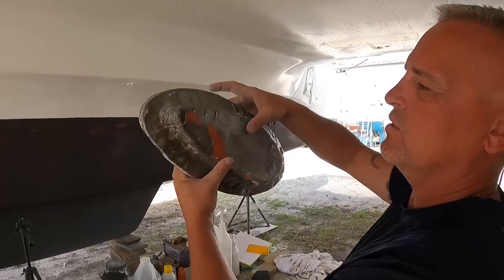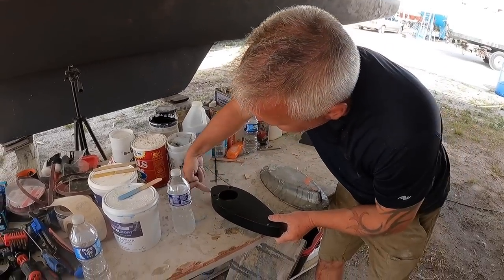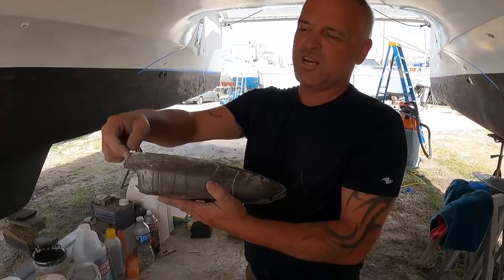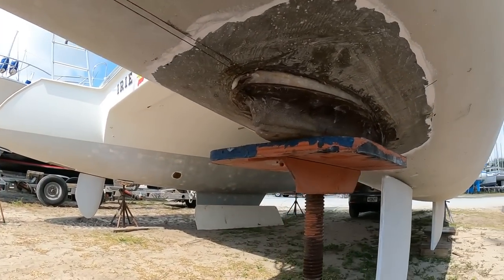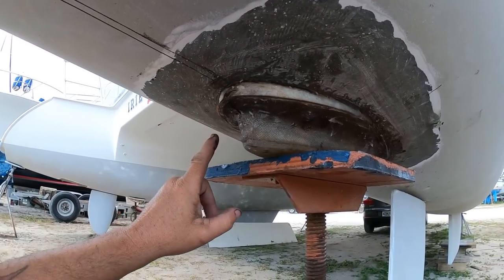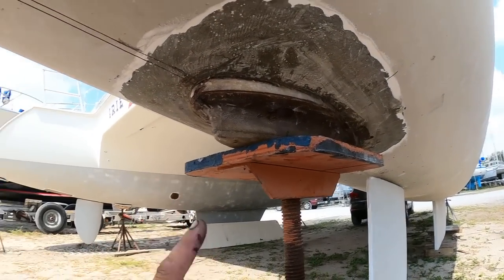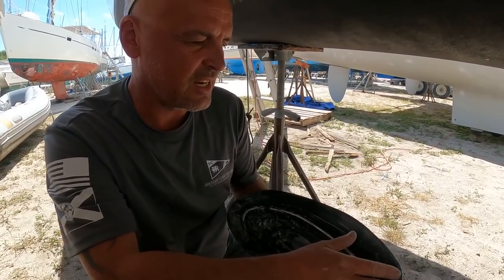I got all my measurements, turned it upside down, and this piece was sticking through with my new shape being angled. I simply built over it multiple times so I could pop it out. When I went to put it back on the boat it was slightly misshapen, so I built it up ever so slightly and continued to make a nice strong mold that we could pull two plugs out of — one for either side. Over the last couple days I've been making this mold. Unfortunately I made it a little bit skinny and it wasn't quite perfect, so I've done some thickened epoxy around here. I've now got all the measurements and lineups right so we're definitely in line with the hull and we've got the waterline as well. I had to just adjust it slightly, so I've got to let that cure.